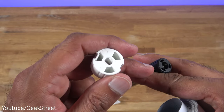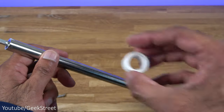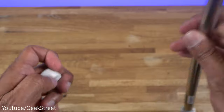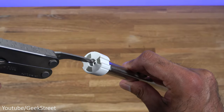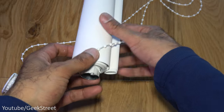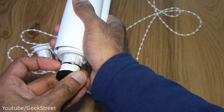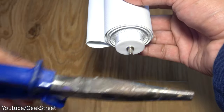To attach the adapter, remove the screw and pull it off. First put on the edge piece that slots on and gives a nice flush finish with the blind - place it in position and it fits snugly. Then place the adapter on and it doesn't move unless the motor controls it. Put the screw back on. For the pull cord end, slot it in - there's a slight notch, wiggle it in for a snug fit, then fit the end cap. I used pliers to gently tap it in.